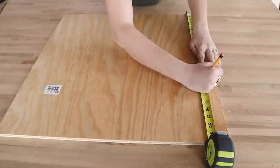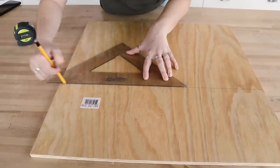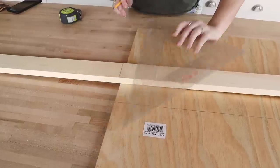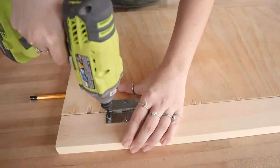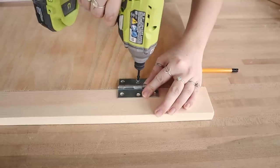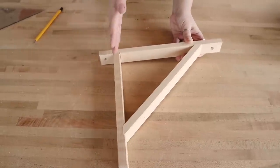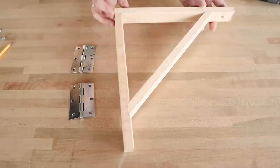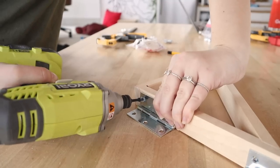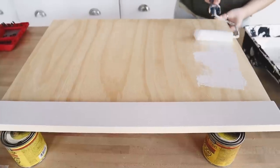Lastly, we have this genius hack: a fold-away table. Tables take up the most room, but we definitely need them. This one is table height — you can use it for eating or doing work — but it folds away. To make it, we started by cutting out a piece of wood big enough to be the tabletop surface, then cut a smaller piece down to the same length. Make sure the width of the smaller piece is greater than the width of the bracket you'll use. Sand down all your pieces, then use two simple hinges to attach the pieces of wood together. Here's the shelf bracket from IKEA — trim off the overhang piece since it'll be in the way. Take two more hinges and attach them at the top and bottom of the shorter side of the shelf bracket. We painted the table the same colour as the wall for extra blending ability when it's not in use.